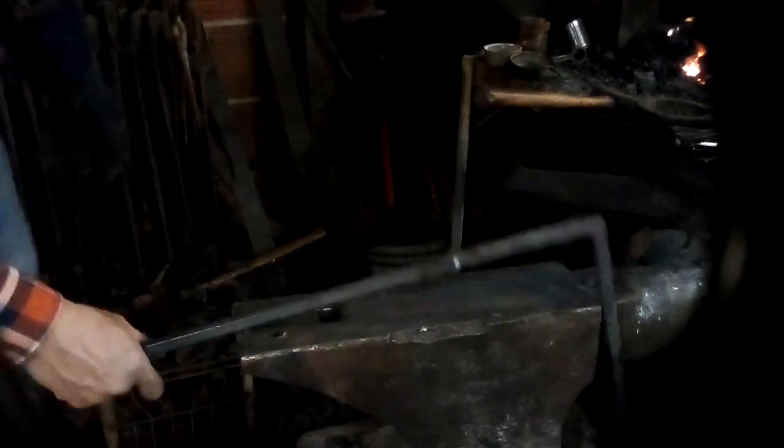All right, so there it is. That's an upset square corner. And I would get out my framing square and check it to see if it needs to be fixed. Here is my framing square. And again, this gets into how compulsive you want to be about this. Yes, it's not quite square. I have to bring it in just a tiny little bit. All right, so I will adjust this thing to be square.